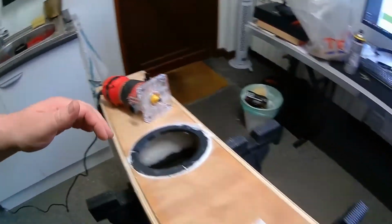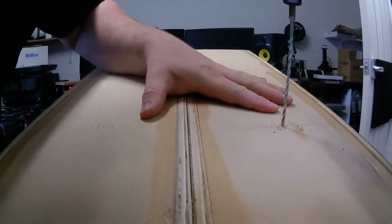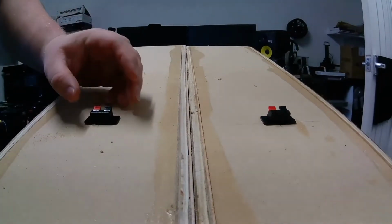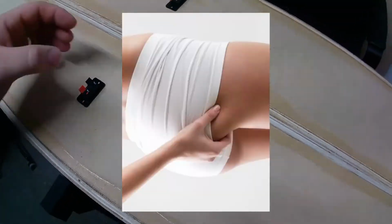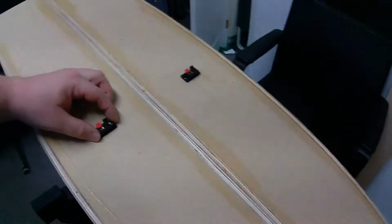What I am going to do is solder up the cables for the cable inserts to go in the back. These are not quite deep enough to go through from the inside, so they are just going to be surface mounted on the back of the speakers. Sitting there. Yeah, I know it doesn't look brilliant with them protruding out the back, but I don't have anything bigger planned. Realistically, we should have some proper gold-plated push terminals or screw terminals. These will have to do for now. In all fairness, those speakers don't handle much power anyway, so no point having massive connectors.